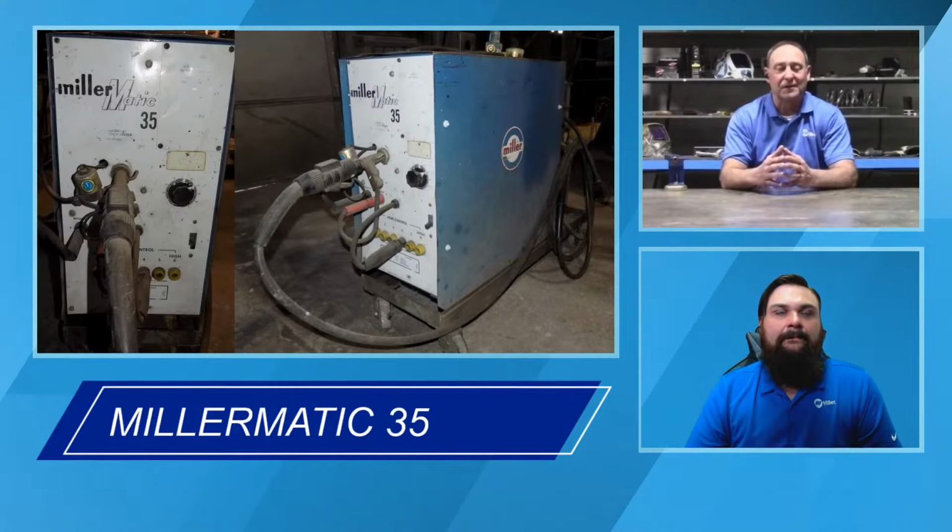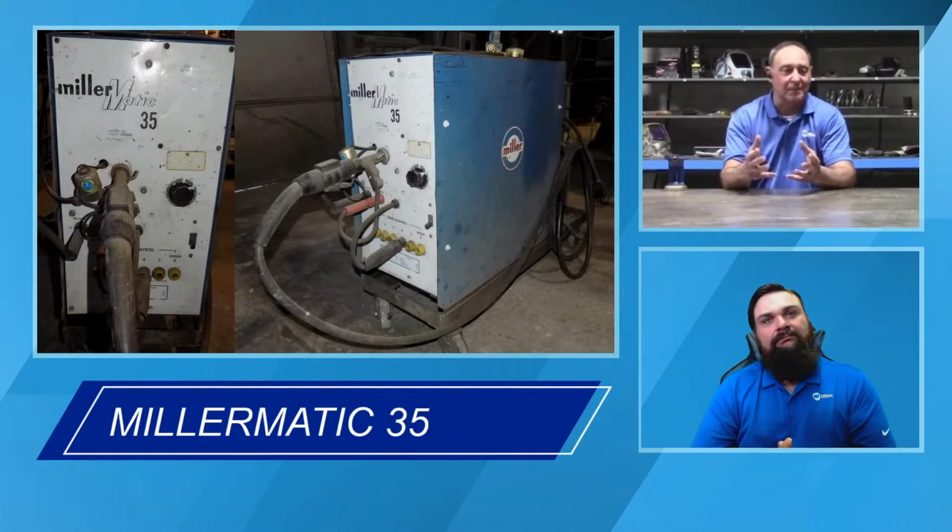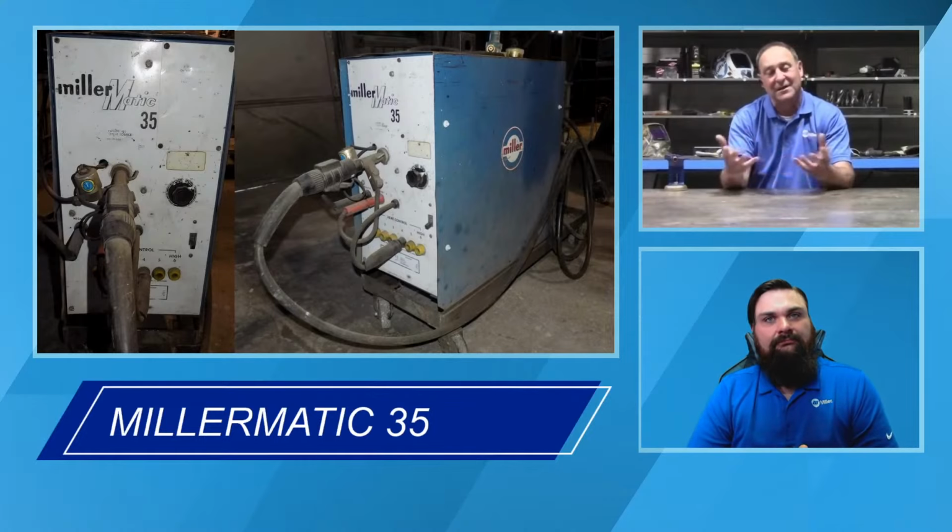So as far as calling it a Millermatic 35, why was it called the Millermatic 35? The reason is back in 1971, .035 wire was the most popular wire being used, and 100% CO2 was the most popular gas. So what the engineers did is that they designed the transformer and the stabilizer and all the welding components inside to optimize the arc starts and the weld performance for that wire and gas combination. Now, on the downside, if somebody would want to use a different wire or gas, the arc quality could have been compromised.